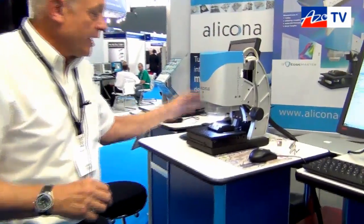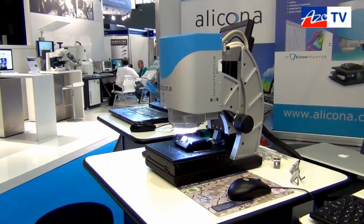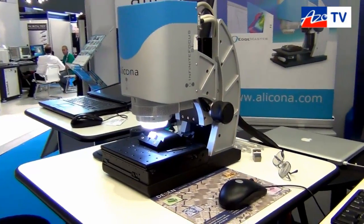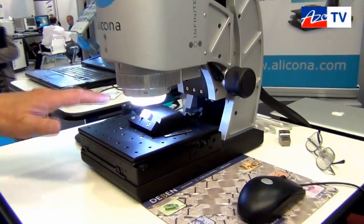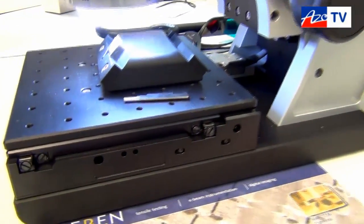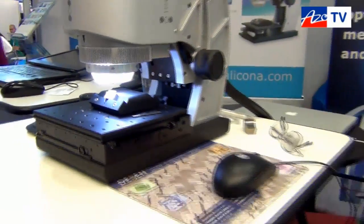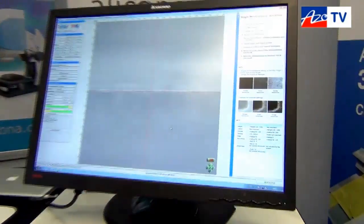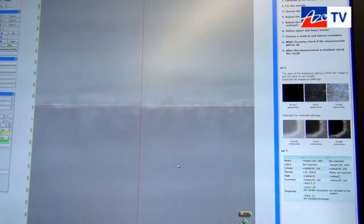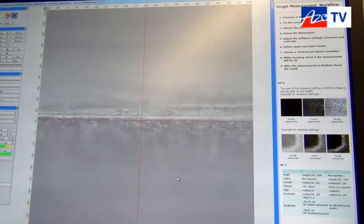The instrument is very simple to use. We have the column and within it there's a sensor with an objective lens and a ring light system, and the sample is placed on the stage. The stage can be moved in X and Y and the head can be moved in Z. We first focus on the top of the arm — you can see it on the screen — and as I move the head in Z you can see it going in and out of focus, which is the focal plane of the objective moving over the surface.